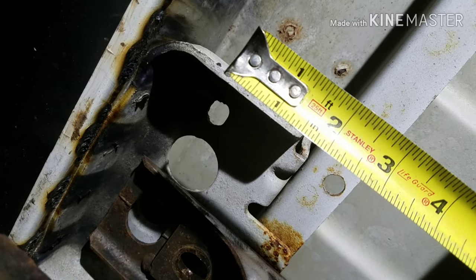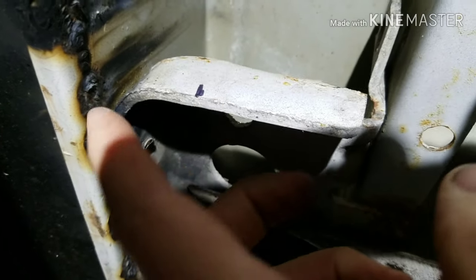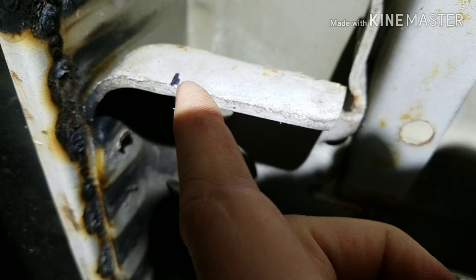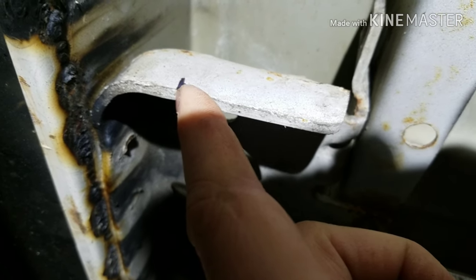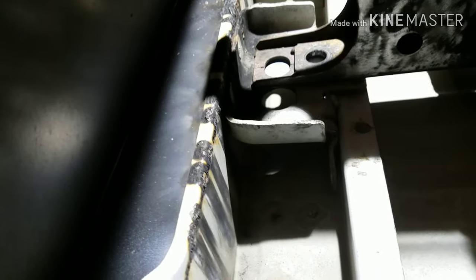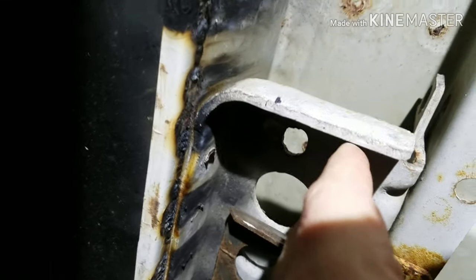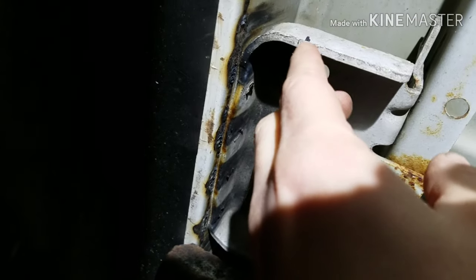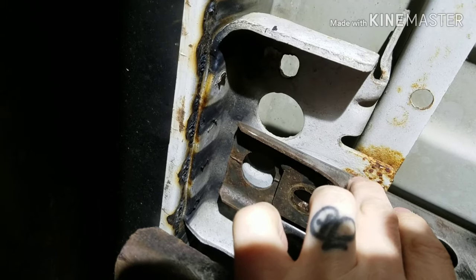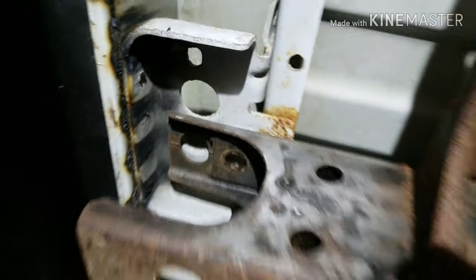And I add another 1/4 inch on that for clearance because I'm going to have to trim this bracket off. So I got that measurement already. I went off the back of the bed for those. I added a 1/4 inch on there, put my mark on there, and then measured from the back of my bed to that mark, and then I just transferred that mark onto that side as well. So then I'm just going to cut these up and over, and that should be plenty of clearance for my bar, because like I said, my bar is going to end up being like 1/4 inch further forward of this line. And it's not going to go up to the top either, so it'll probably be down 1/4 inch from the top of the chassis, because I'll make it closer to the bottom than it is at the top. But yeah, that's what I got so far.